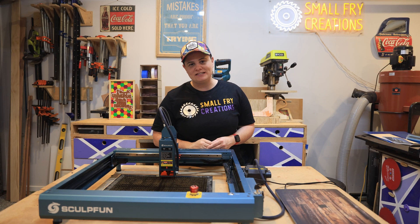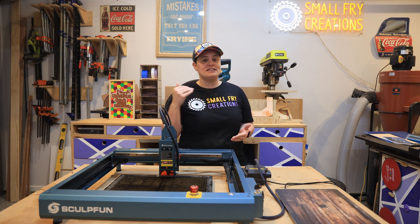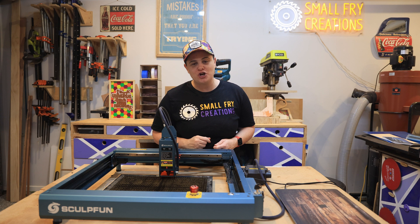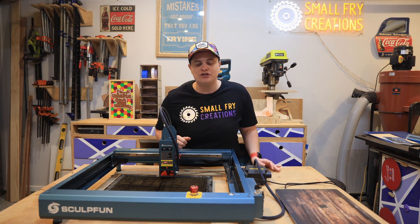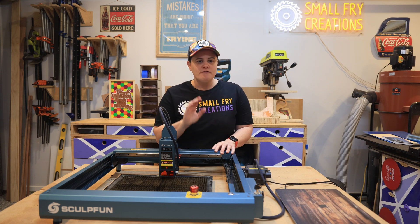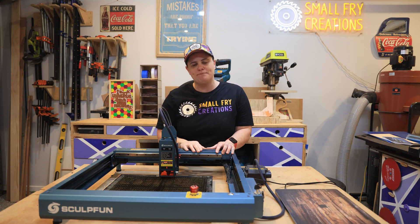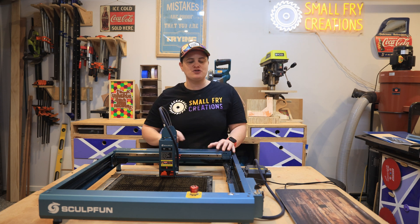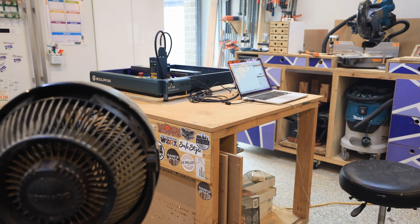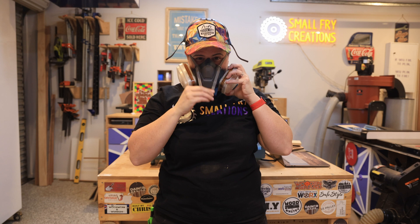Fact number four: lasering is dangerous and precautions need to be taken — this is more true today than ever. It blows my mind that over the course of two years we've gone from 5 watt to 40 watt lasers being commonplace in the workshop. With that speed of innovation comes the need to stop, do some research, and make sure you're taking the right precautions. You really want to be operating your laser in an enclosure. You also want to be in a well-ventilated area with fans and windows open, and you must wear glasses — exposing your eyes to a laser beam over an extended period will damage your eyesight. You only get one pair of eyes.